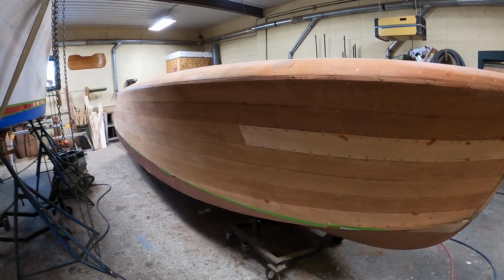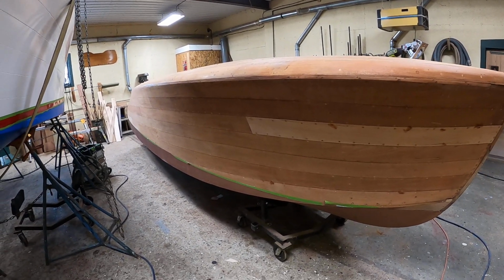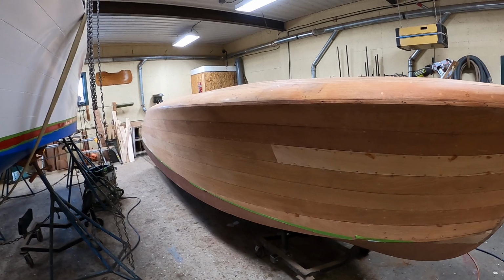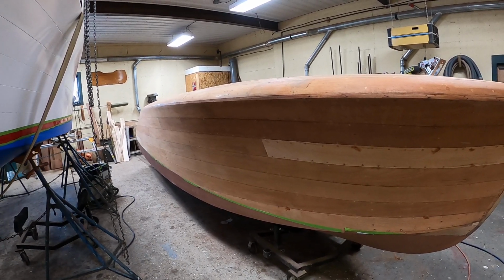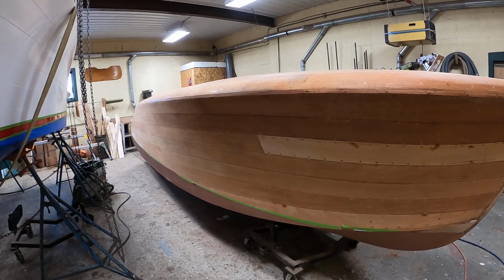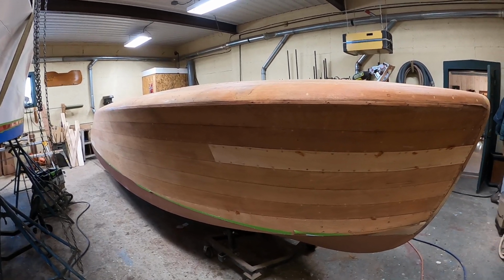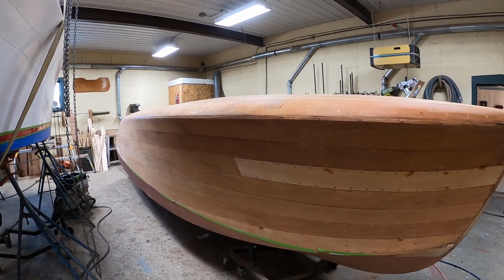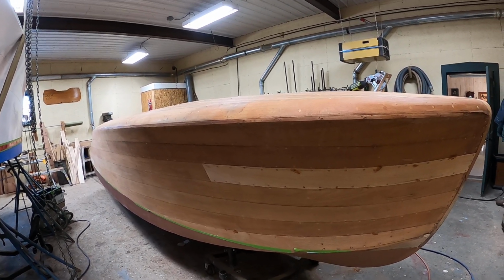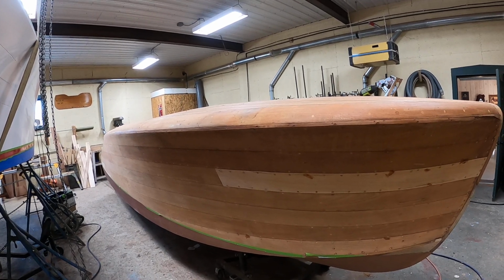His recommendation, and we've started using it with great results, that first coat, Joe, it's about 50-50? It's about 50-50. Yeah. We will take the thinner that is appropriate to the varnish we're using. First coat is diluted 50-50, and we lay it on and let that cure, and then we'll begin with our Pettit high build, sanding periodically, every four or five coats, and building coats. We'll do 10 or 15 of those, and then it's seam time, and then it's Pettit Captain's Ultra Clear varnish to finish off the process.